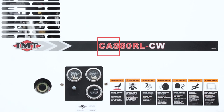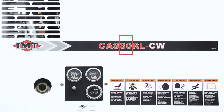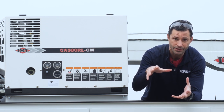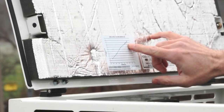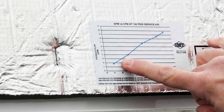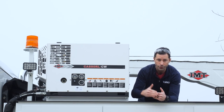What do these letters and numbers mean? CAS stands for compressed air system — all of IMT's air compressors start with CAS. 80 stands for 80 CFM, which is cubic feet per minute — the volume of air this compressor will make. 80 CFM is your max, and it's going to vary based on the GPM — gallons per minute — out of your hydraulic system. 20 gallons per minute gives you 80 CFM; if you give it 14 gallons a minute, you may only get 60 CFM.